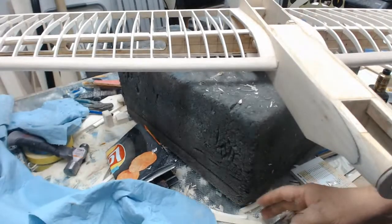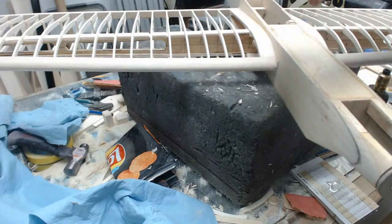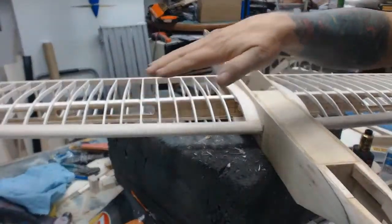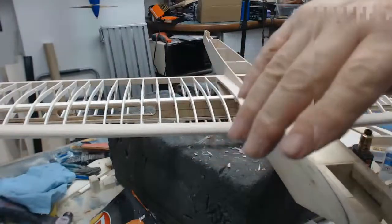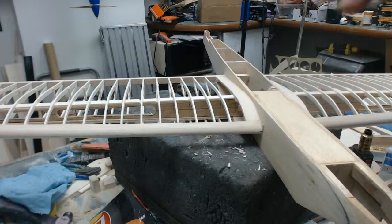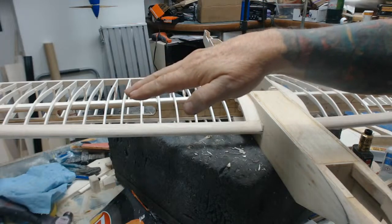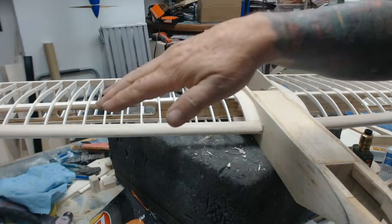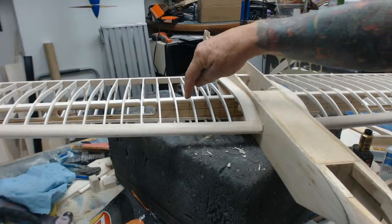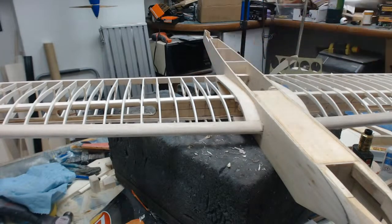Now, if you think about it, because you're standing up, the lines are going down like this. The first wheel to touch, flying models, right? The first wing to touch is the outboard wheel. So it's the one that takes most of the brunt of the impact if you crash into the ground. So you can have that torsion box long on the outboard side. Plus, you need outboard wingtip weight anyway.